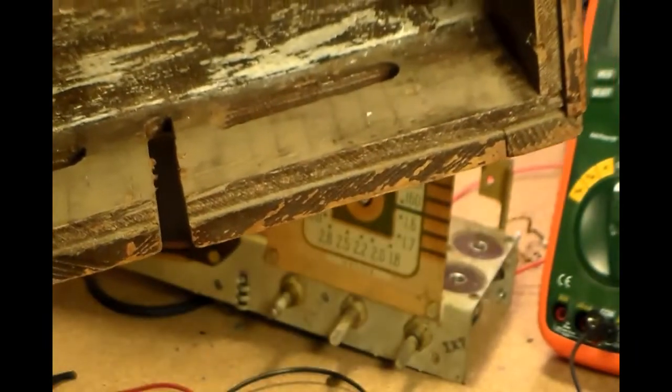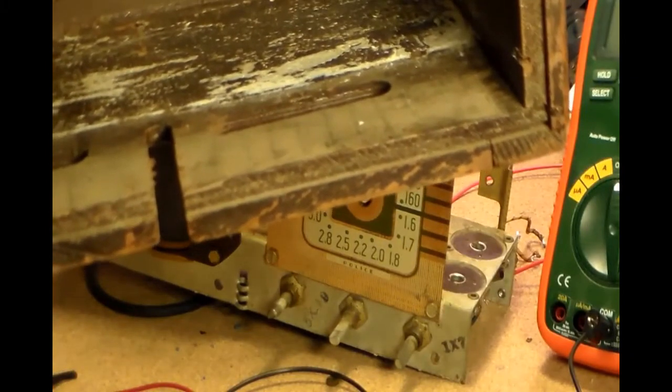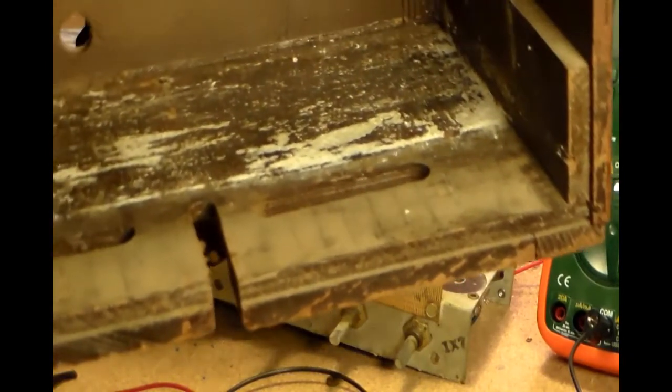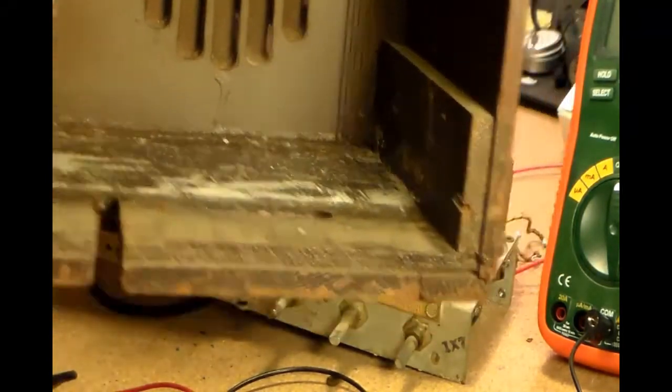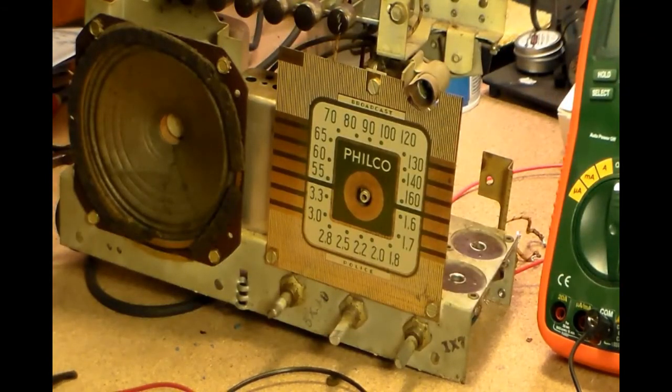This had an asbestos pad in it, and it went up the sides and along the bottom and up the top. Basically what I did to it was soak it with soapy water, let it sit for about 5 or 10 minutes, and then it actually just peeled right off. Folded it up, tied it up in a bag, and we just won't tell anybody what I did with it after that. So I think I'll lacquer it up just to seal what's left of it on there. I don't want to scrape it up and get it all airborne.